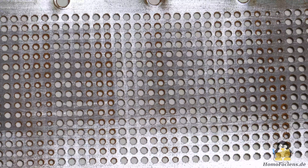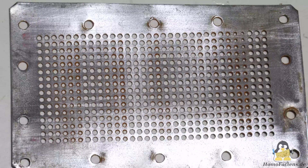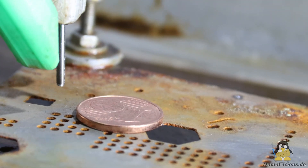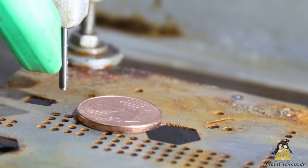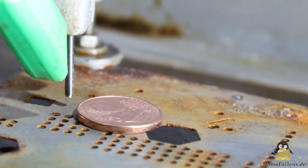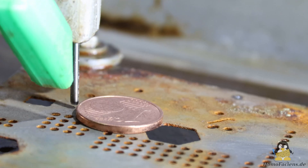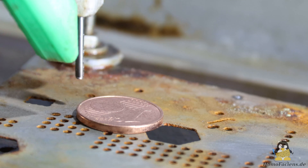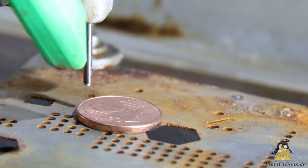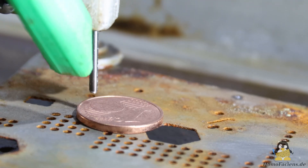From time to time I stopped the drilling process and manually pushed the electrode further down to compensate for the erosion. A reference point still needs to be implemented where the current electrode length can be measured. A simple metal plate connected to ground is sufficient. You have to ensure that the voltage of the welding inverter is separated from the electrode during measurement, or that a high series resistance is switched into the circuit — I have already ordered relays for this. If the workpiece is connected to ground, it can be probed with the electrode, which will significantly increase the precision of the machine.